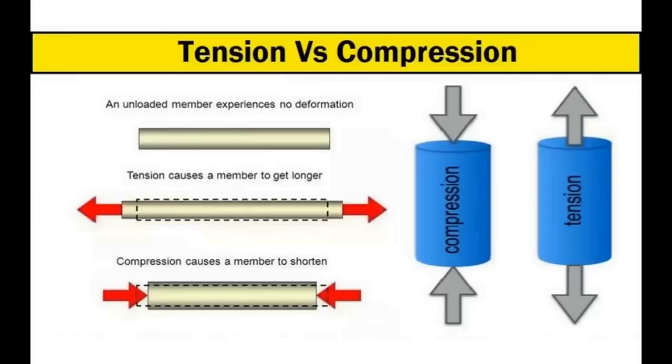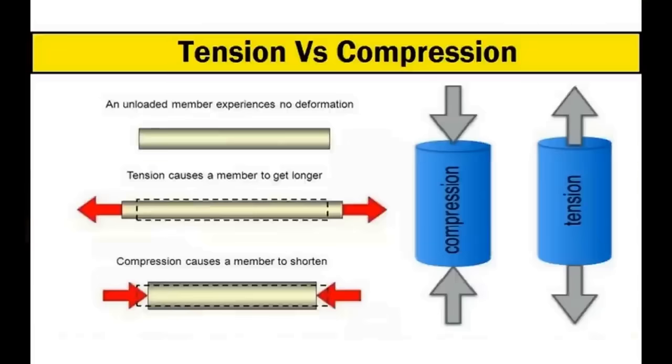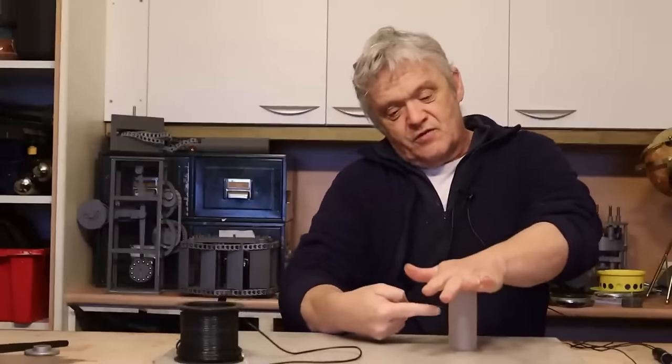The principles are compression and tension. Compression is when you try to squeeze something together - tubes are brilliant for this, which is why wood is good, because wood is basically lots of tubes packed together. Tension is when you pull something apart - bits of string and wire are very strong in tension but have no compression at all, they just fold up. Tensegrity is the arrangement of things so they only have compression where they're good at compression, and tension where they're good at tension.